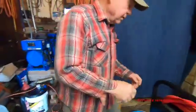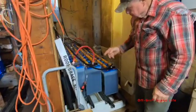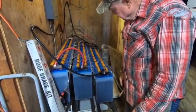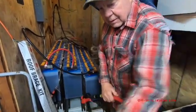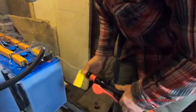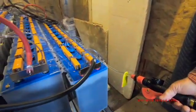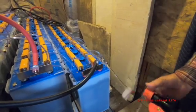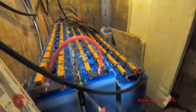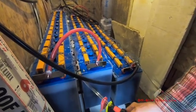This is a watering system that was designed by them at Iron Edison, and we just plug it into our battery system here. As you can see, our batteries have tubes going to them, so we can fill those batteries up very quickly and without overfilling them. They shut off automatically so they don't overfill. So we just fill these batteries up — the first set's already done. All the batteries are filled for another month. Simple as that.